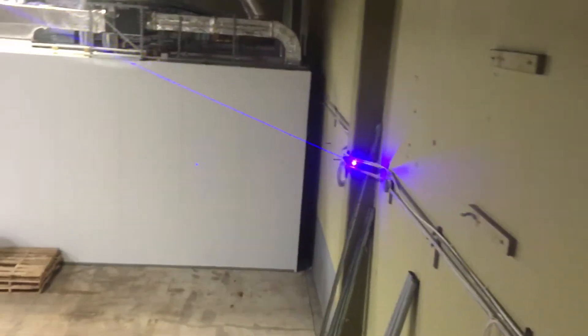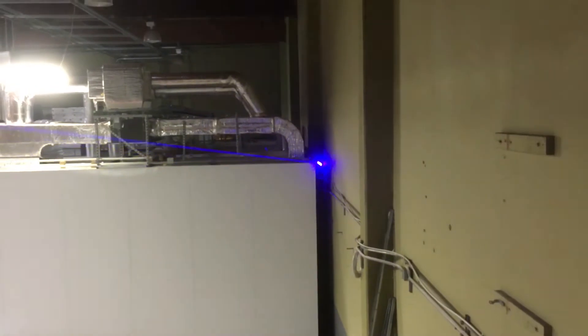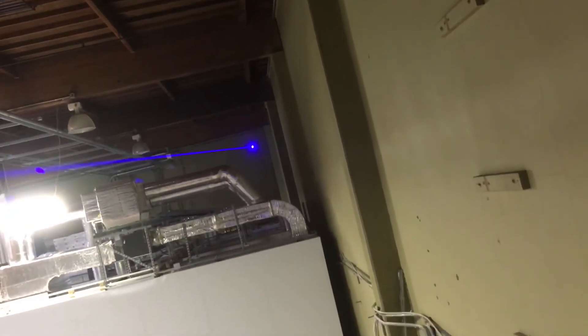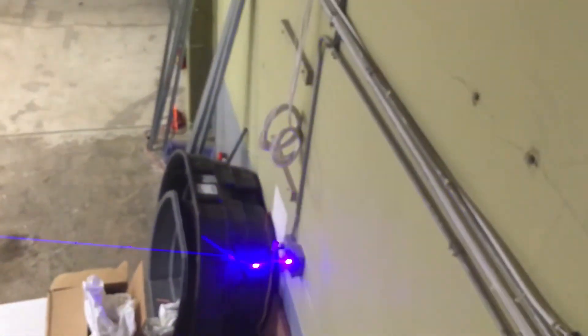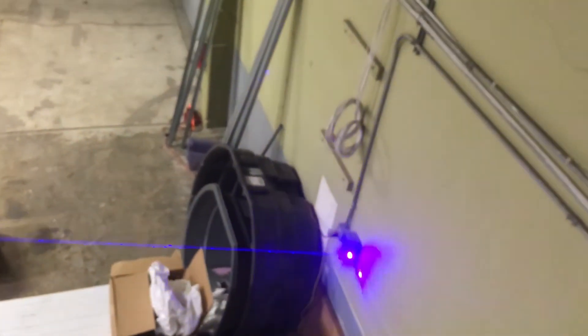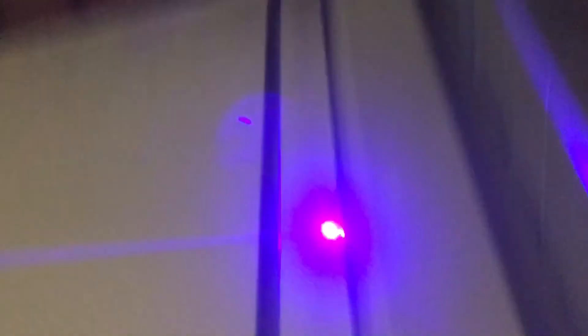I see they have one hot, and following that wire labeled hot, I trace it all the way over there — it keeps going behind the wall, running in the direction of the circuit boxes, going down. That's where it says 'fans' and 'roof fans.' So this other one must go to the sensor. Following it over, it goes down to that box right there. That box might energize those to make the contactors come on and then feed power up to the roof. Let's see what I find.